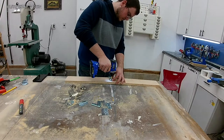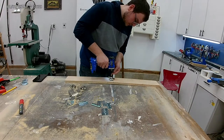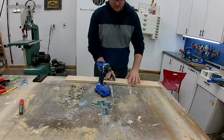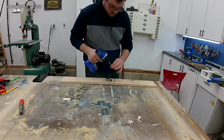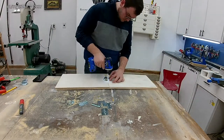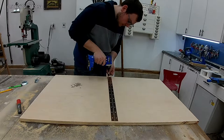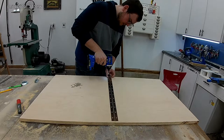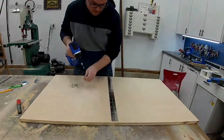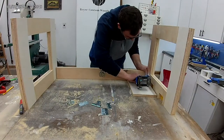On the back sides of those hinges, every single rail gets a window sash lock, which acts as a lock to keep the rail in a 180-degree orientation so the cart can't collapse on you while you're working. My top for this was a split top to keep the folding cart even smaller in footprint when collapsed, so I was able to take a 48-inch piano hinge, cut it in half, and use one half for each cart.